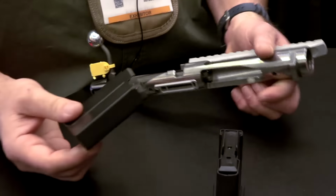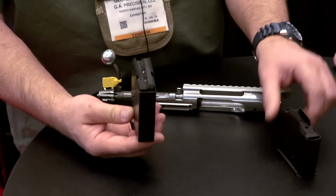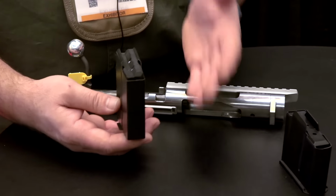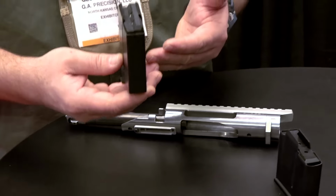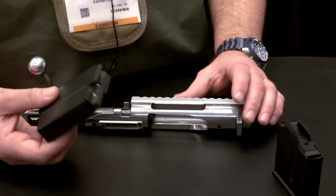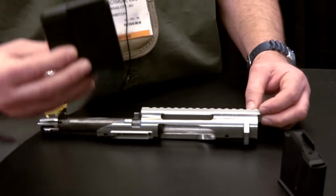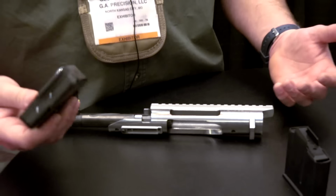It also allows, when it's in the gun, to be top loaded, where you cannot do that with the AICS mag. These mags have been used with traditional 2-lug actions, but the position of this magazine has to be hypercritical in the receiver to work. So, a longer latch, a receiver cut that allows us to come up high enough in the bolt, all of that's already built into the Tempest action. And you can have a gun built either in a chassis or embedded into a stock with a trigger guard that feeds this magazine absolutely flawlessly. Now it's the whole decision in using this to start with.